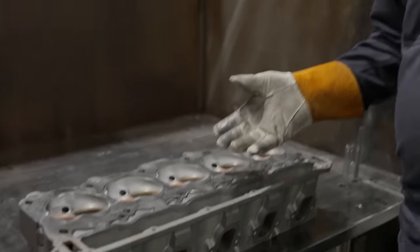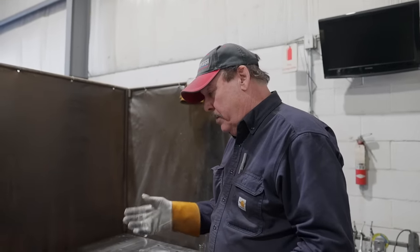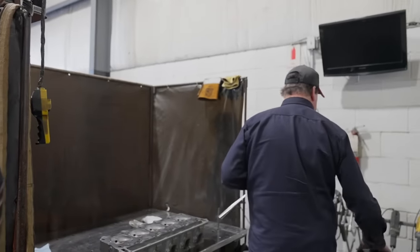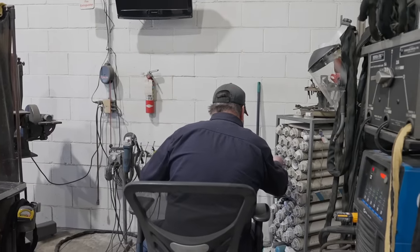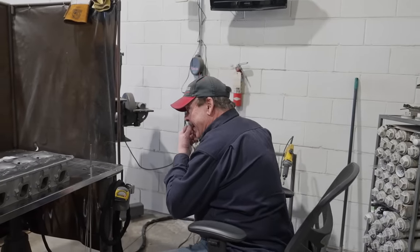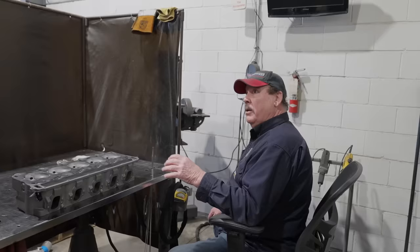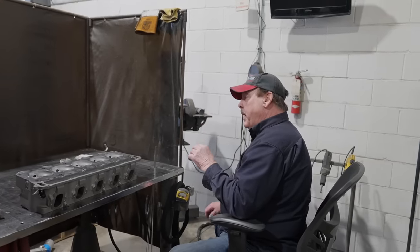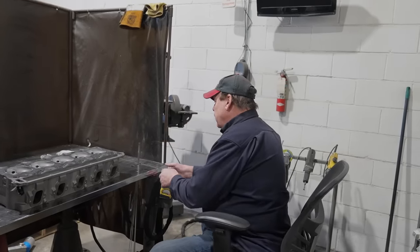The old days, the old welders had a hard time welding that, but the new stuff, it's not that big of a deal. I mean, you don't want to be welding oily stuff, but this is more than clean. I'm going to use a different 5000 series rod than I usually use on the top fuel heads. And I do a lot of O-ring work, a lot harder than that. And the machine's nice. It'll be a little brighter in color, shinier, because it's harder. That's fine. But that way you don't have to worry about if you're on the edge of that new weld in the parent metal. I think that's a better choice.